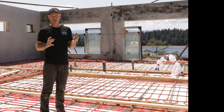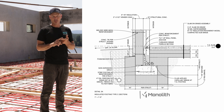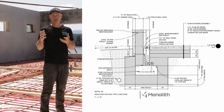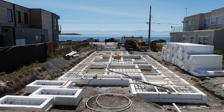I want to talk about the footings for concrete insulated panel homes. There are two ways we can do our footings. One is to fully wrap the footing with insulation — we use a geofoam structural insulation underneath the footing and then the same product for the walls. I prefer that system because we can build the whole footing out of insulation and just pour the concrete into the trough, or the forms made out of insulation. There's no stripping, no throwing wood away, and less waste.